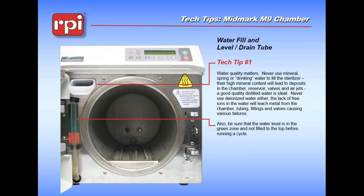I can't tell you enough about water in this machine. The other thing you don't want to do with water is use deionized water. We use distilled water, not deionized water - there's a difference. In deionized water, they've actually removed all of the electrically charged free radicals from the water. But water really wants those free radicals, so it will literally pull them out of the copper tubing, out of the brassware, out of anywhere it can find them. Deionized water will decay the tubing in the machine and can damage the brassware. So only distilled - nothing with minerals in it, and never deionized.